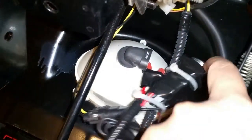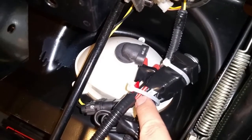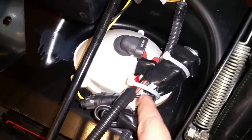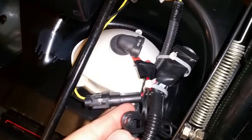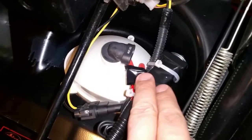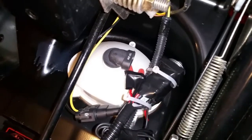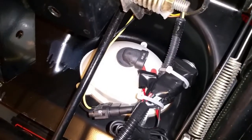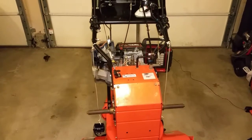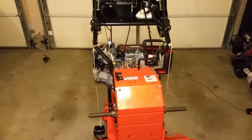The wiring is pretty straightforward. I've got a bridge rectifier with a couple of fender washers and a heat sink. I added a 4700-microfarad capacitor at 25 volts. I took the existing plug that would normally go to the light and made an input plug into the AC, so the AC goes in, gets rectified, and then feeds all the LED lights. I still need a little more research, but in the next segment I'll show how to tap the holes and the right sizes.